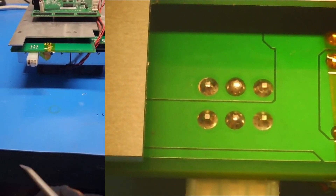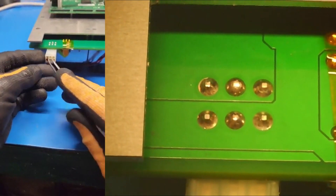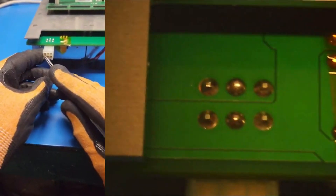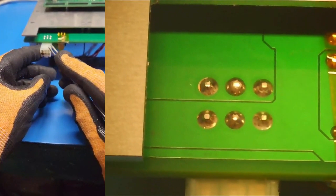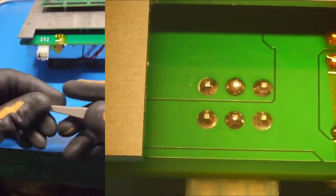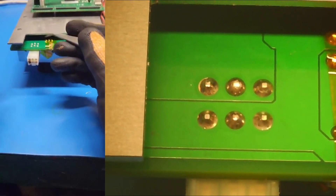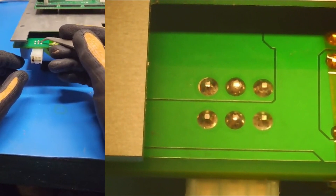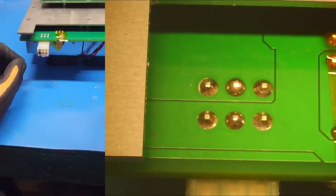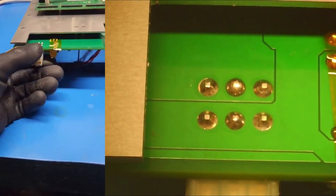As you can see, this PCI 6-pin has been damaged — I think this unit was overclocked and it basically joined these two. This is actually an adapter on this. So what we're going to do is do through-hole soldering today. You can see here there are six solder joints that I have to loosen up and then detach this.